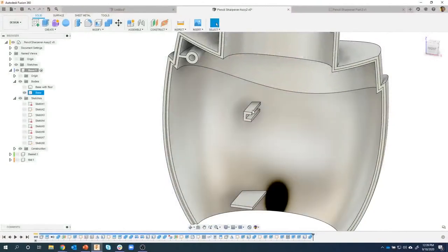You're going to have to have the knowledge to, do I add clearance here? Do I have to have draft? Is there an undercut? That kind of a thing. If I were to add GD&T into every single feature, it would take a really, really long time. So that's why I don't do that. However, it's obviously important in product design. I'm just not a specialist in that. So hopefully you'll forgive me for that. I'm more showing tips and tricks and methodologies.